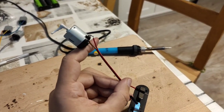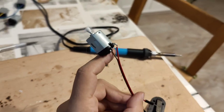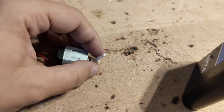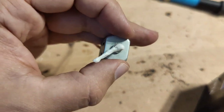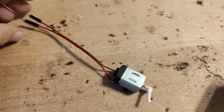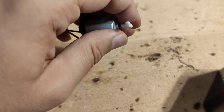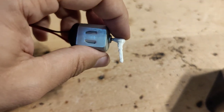Now that all issues have been fixed and everything repaired, we have a completely operational little motor — and that applies for all four. One thing: if you wonder why this particular shaft — it can move in both directions depending on where you put plus and minus, so you can use it as a sort of replacement for a solenoid. Solenoids are a lot more expensive than electromotors; a bag full of electromotors sometimes costs as much as one quality solenoid. But if you just need some sort of solenoid, maybe such a thing with a little plastic toothpick lever is the correct solution.